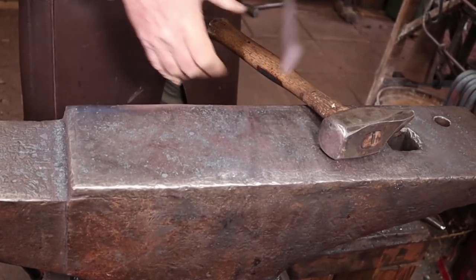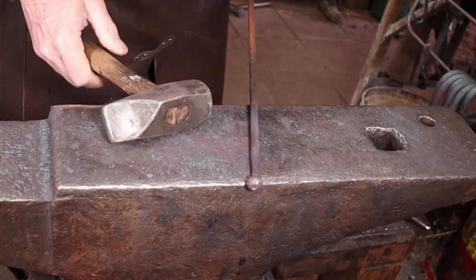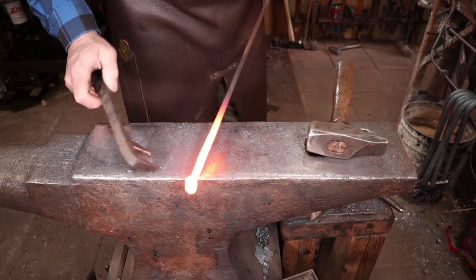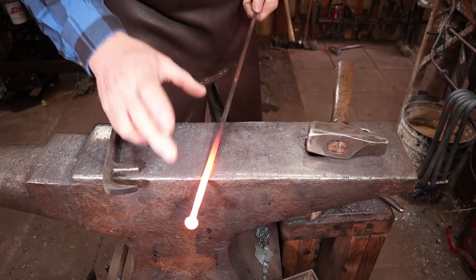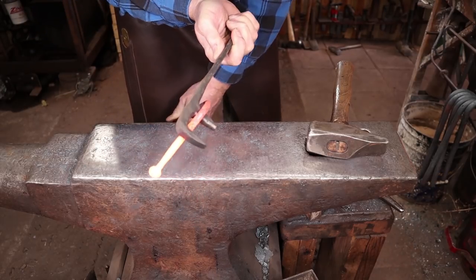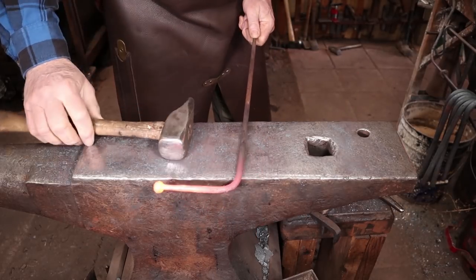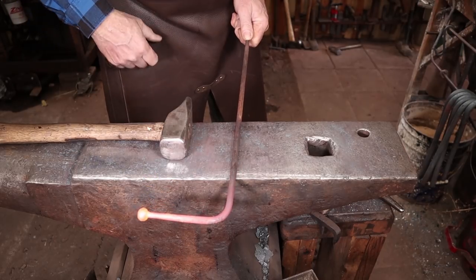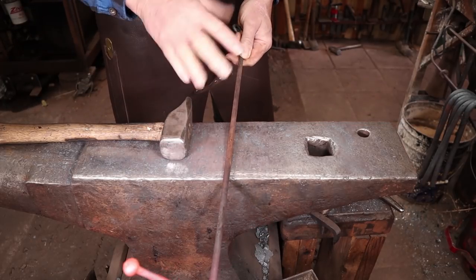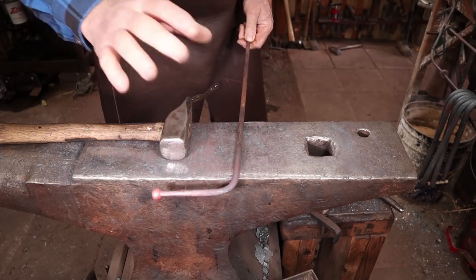That definitely leaves a shoulder that will need filing or grinding. I'll just go do it and come back and shape the spiral. I want to leave enough to make the hook out of, and I'm not sure exactly what I want that to look like yet, so I'm hoping it kind of speaks to me as we get close. I'm just going to bend that over at about a 90-degree angle just to get it out of my way so we can scroll it this way and leave that sticking out. I'm not going to worry about the relationship between this scroll and that scroll — round bar you can twist to line up and it doesn't show like it would in square bar, so that gives us some freedom.